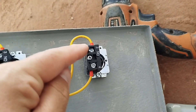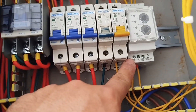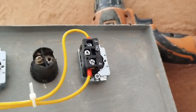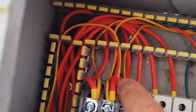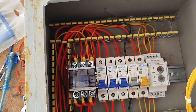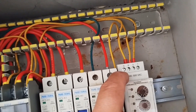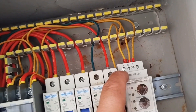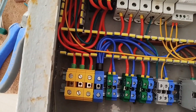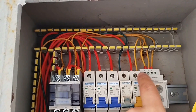As you can see, the input of this switch is connected to the relay output and its output is connected to the contactor coil. On the other hand, we know that the contactor coil and the phase control relay both require a neutral wire. Therefore, we connect the neutral wire numbered one from the main neutral terminal to these two.